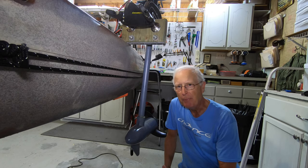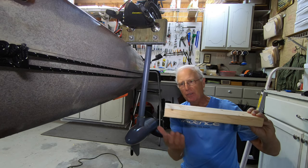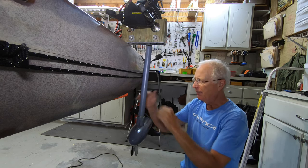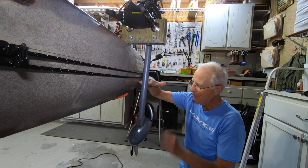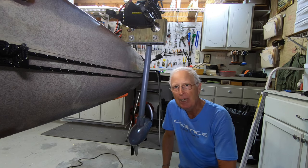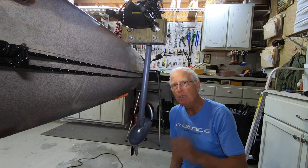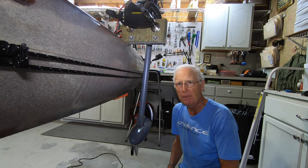Let's look at the second benefit of moving this thing back and changing the way it's mounted. You can see I've taken out an inch and a half of distance on my shaft, and on this motor the shaft is only 24 inches. So that inch and a half gets the propeller an inch and a half farther down. With my water line being about here, you can see that my propeller is now in the optimum range for thrust for this particular motor. When I measure the distance over to the rudder, it's only 12 inches — so the thrust is closer to the rudder and the rudder is going to be more responsive.